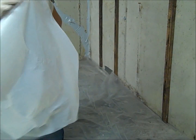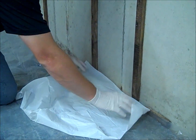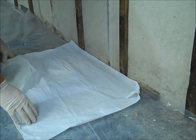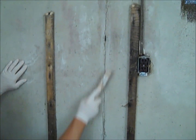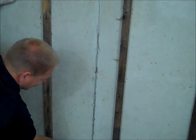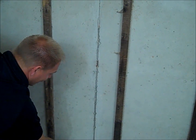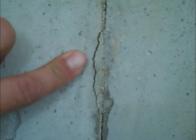Open the plastic bag included and place it under the crack to be repaired. If additional protection is needed, newspapers can be used. Clean the surface of the crack with a wire brush, removing loose paint, dirt, or concrete, then wipe the surface clean with a rag. Inspect the crack to make sure nothing is blocking the surface that would prevent the ATEC 212LV from being injected. If so, remove the blockage.